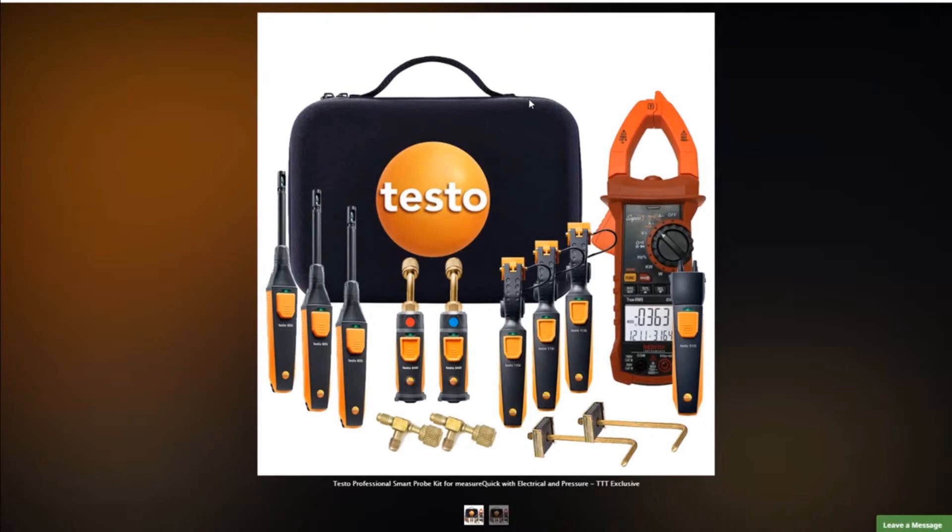So the MeasureQuick set looks like it has a dual port manometer from Testo — the 510i. You get the static pressure probes, probably some hose in there, two swivel tees, the Redfish multimeter, three pipe clamps, two pressure probes, and three hygrometer probes. So you're doing discharge pressure, a discharge temperature as well, and then you can do power factor and everything with the Redfish. That's pretty good. I guess one of those hygrometers is ambient outside. Weaver's been watching the show for a long time — it's been my pleasure because he seems like a really great guy.